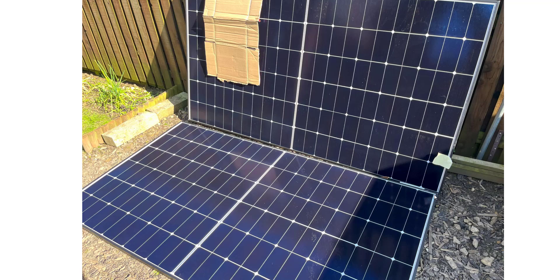These solar panels are absolutely huge, so make sure you measure up the roof area before you buy them. In the UK, the standard size for commercial roof solar panels is usually about a meter wide by 1.4 to 1.7 meters long. These ones are a meter wide but two meters long. Standard commercial panels tend to be about 435 watts; these ones are 535 watts. This solar panel is a traditional monocrystalline type glass panel with glass on one side. These days a lot of installers fit bifacial panels with glass on both sides, capturing sun from the front and also bouncing off the surface behind the panel.